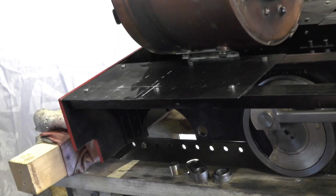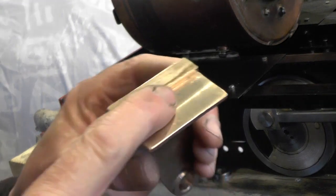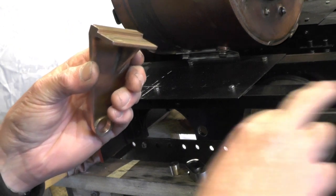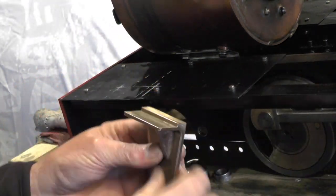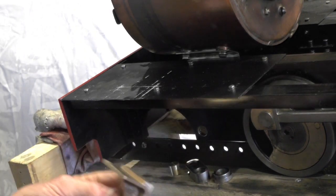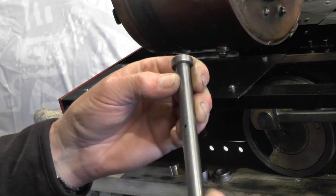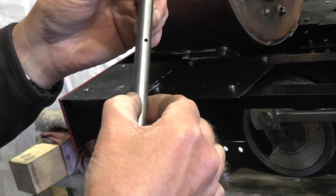I've got the brake support bracket completed, and I've had to mill that recess in that face because I'm putting an angle straight through my loco for the foot plates to go straight through. I've had to form that bracket to fit round that angle underneath. I've got the brake shaft completed and all the relevant holes drilled in for the crank and for the collars,